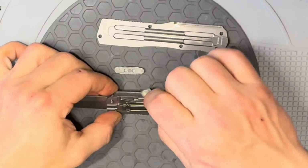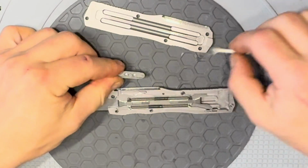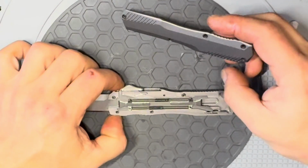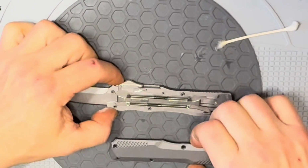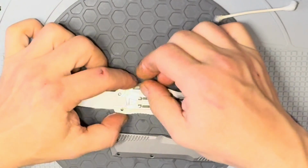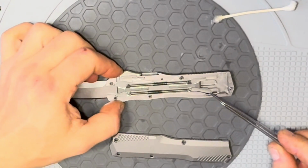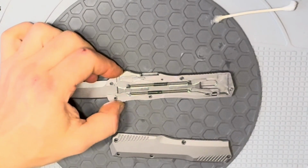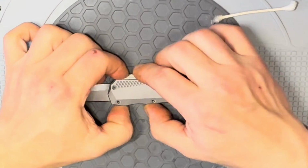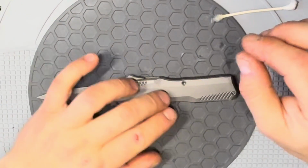And obviously you need to lube the inside of the firing lever slot, and just in case, both surfaces. The firing lever has a cutout that engages a protrusion on the mainspring frame, which drives the frame back and forth right here. Last quick check here, make sure that the mainspring frame is not on top of the locking gate plate. My left hand here applies the pressure toward the frame onto the firing lever while I'm placing the front cover